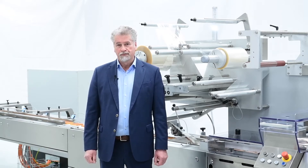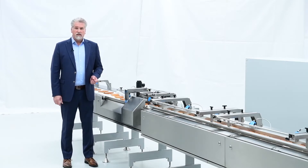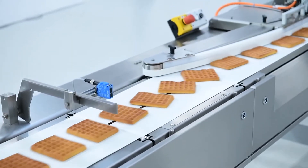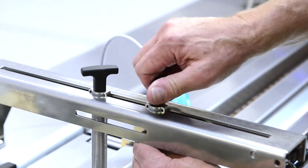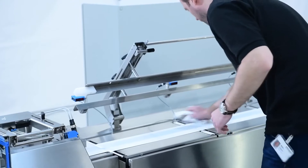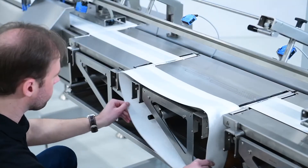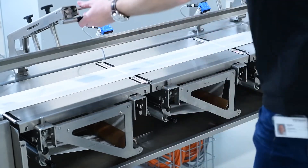Let's take a closer look at the system. The PEC Feeder 5 is a modular system that can be configured according to your needs with different options. There are three features I would like to highlight on this machine. To provide the requested flexibility, the alignment unit can be adjusted from 15 to 170 millimeters, allowing a very fast changeover from one format to another. The new side guide construction and open design makes it easy to clean. The new belt tension system allows for toolless belt removal and robust belt tracking, making it possible to easily clean the belts and provide a more stable product flow.